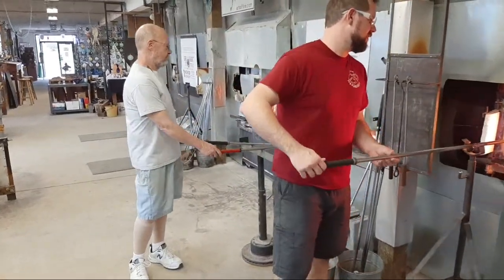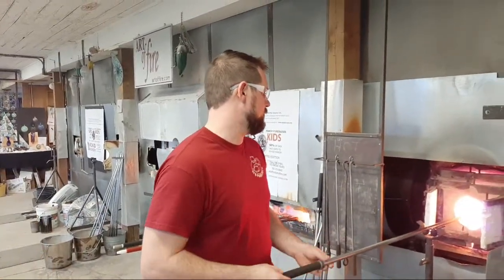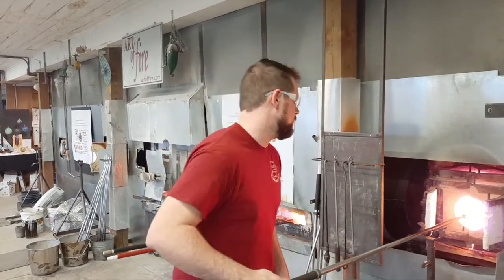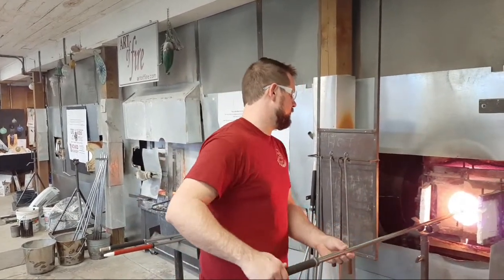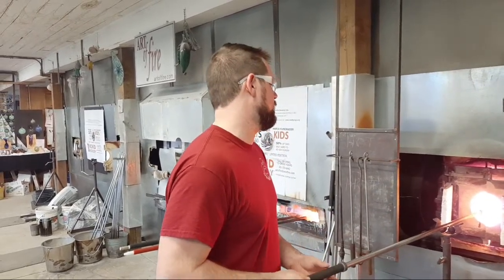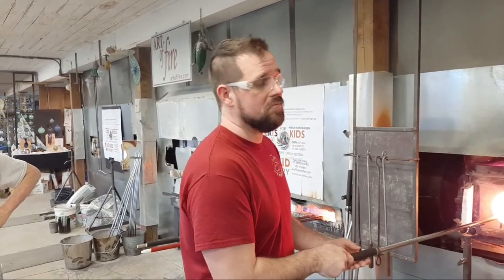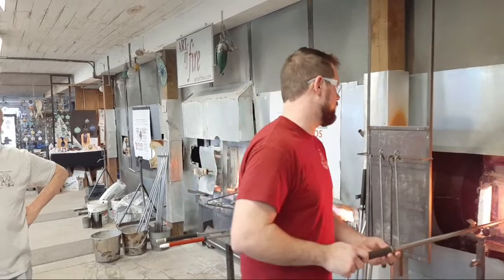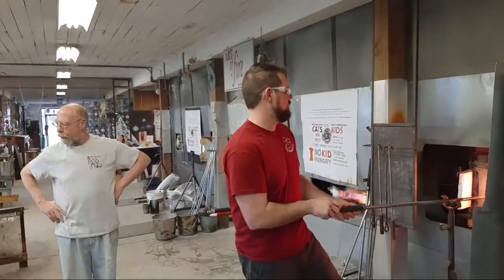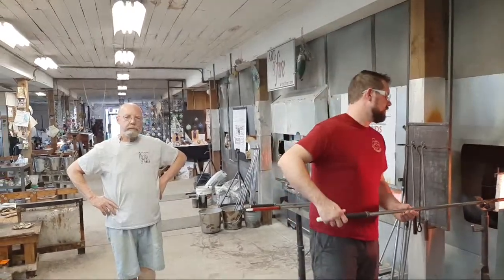With the turning and pressing with tweezers he's got it centered. Water weakens the joint, then a tap breaks it free. Foster will take it to the glory hole to begin reheating. That joint was cold enough to fracture — it'll take a while to reheat to the point it's malleable again. He'll be able to manipulate it into the shape he wants, which will look very much like a drinking vessel. After he jams it onto the wood the shape will get distorted a little at the bottom.